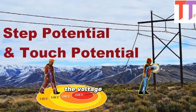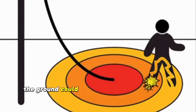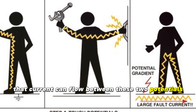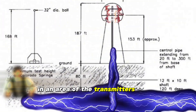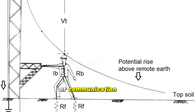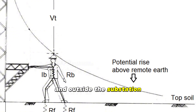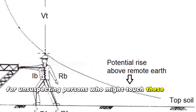The voltage gradient — the change in voltage across the distance to the injection point — might be so high that different points on the ground could be at significantly different voltage potentials, allowing current to flow between them. This creates a hazard for anyone standing on the earth in an area near insufficiently insulated transmitters. Pipes, rails, or communication wires entering a substation could see different ground potentials inside and outside, creating a dangerous touch voltage.